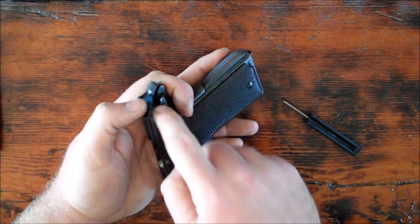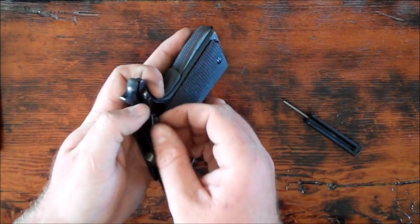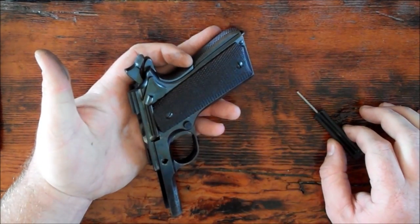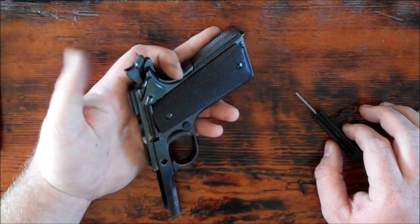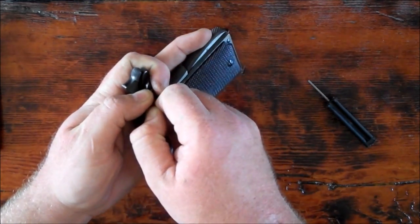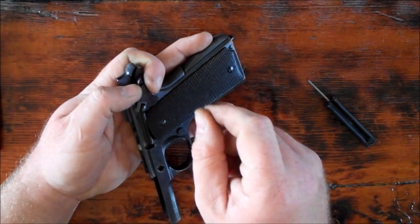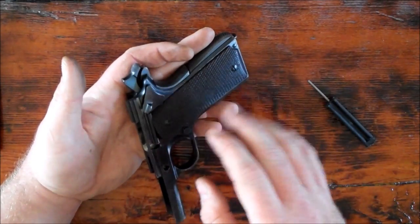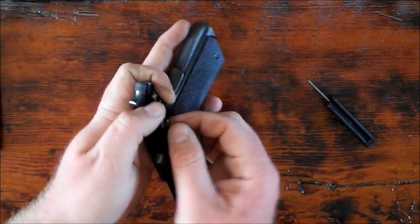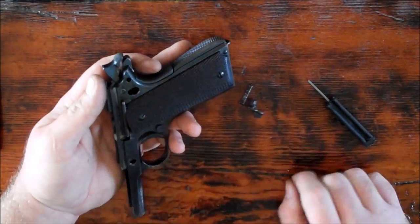You want to keep that thumb down flush with the frame. That's the full on position, that's the full off position — about halfway in the middle is the position that's going to let you remove the thumb safety. It's just started to come out very slightly, so pull very slightly on the pad there. Wiggle it back and forth just a little bit and pull on it. Ambidextrous safety is a little bit different — sometimes they're much tighter, but the concept is the same. And there we go — thumb safety has now been removed.